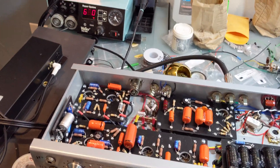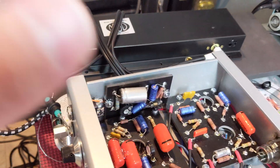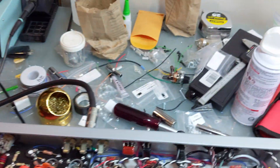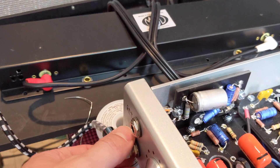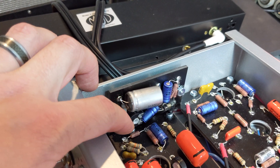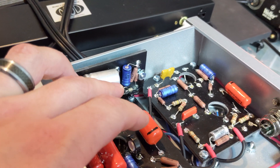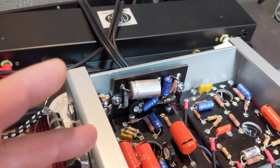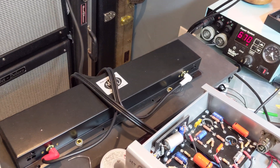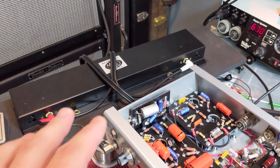The last thing I'm troubleshooting right now is biasing the FET. The FET channel is super low volume. This is basically the only amp I've seen that uses a 220k or 230k voltage drop resistor, and after that I'm only getting about three volts after the 10k — it's supposed to be a lot higher. I need to look more into this area to get the FET to an appropriate volume. Right now you have to crank the gain to get a good level.